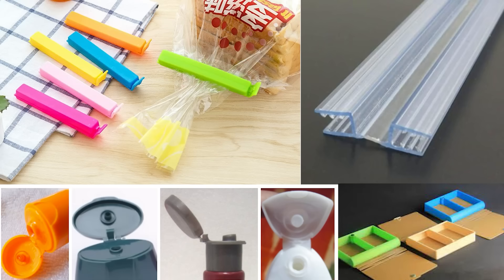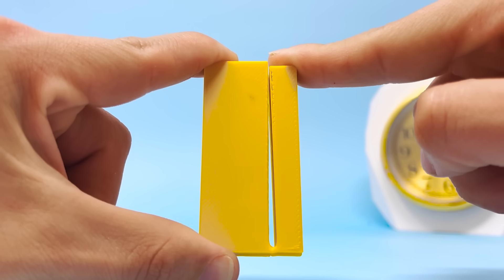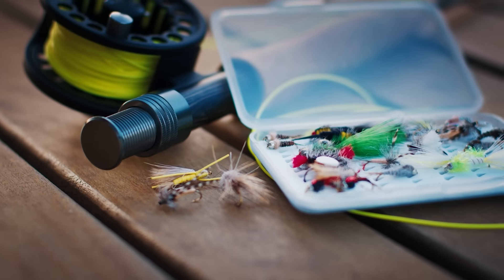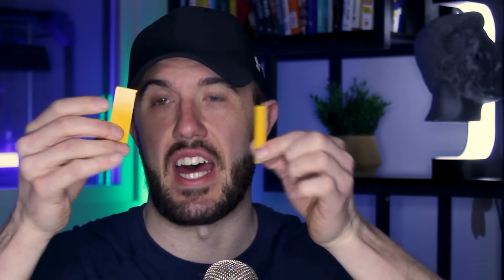There are a lot of different types of living hinges, but inside of 3D printing you have all kinds of different options because you have more control of the pieces you're making. The most traditional living hinge is literally just a thin flap of material, made very thin so it can flex without fatiguing. These types of living hinges do have an issue because they wear out. They're often used on something like old tackle boxes or small enclosures, and they can't be used many, many times, and they can't flex through very long distances — otherwise they break.